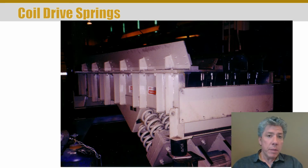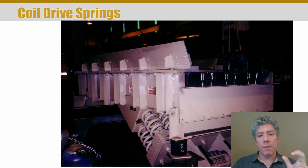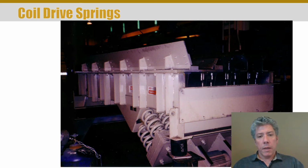Now this can be good because these things act to dampen out oscillations. So the black rubber thing you see there that has writing on it, and you can tell there's another one in the shadow on the right of the picture at the bottom, those I would still consider a type of spring, but they're a very lossy spring. And of course these also behave very non-linearly.